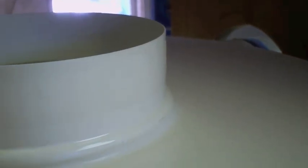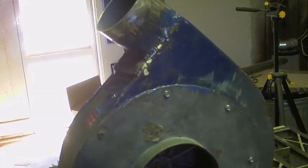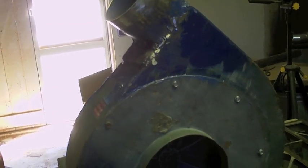To prepare the dust collector for its outside life, I've gone ahead and run a bit of silicone around this rolled seam. It looked tight, but there'll be standing water up here on occasion. Standing water and vacuum — you'd pull something through a pinhole leak that, in a regular shop, would probably plug with dust over time. Mine won't. And then, once again, I've taken the motor apart, the fan apart, and rotated it — it's like the fifth time. Every time I picked a spot and measured it out, I found out I hit something. So this one finally does work, and I'll just come directly sideways off the thing.